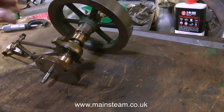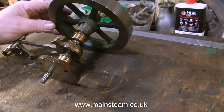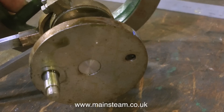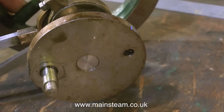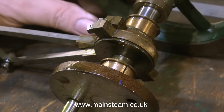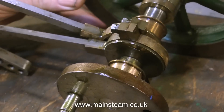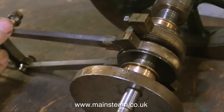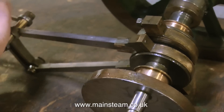Having a quick look at this crankshaft, it looks very well made. The flywheel is turned nicely. I'd almost like the way that the crankshaft itself is recessed in the middle of the crank web, though it's better to have it protruding slightly. Thankfully on this crankshaft assembly there's not much rust to remove. Some of the engines I work on are incredibly rusty - I spend many hours with files, sandpaper and Scotch-Brite to clean them up - but this is going to clean up very easily.